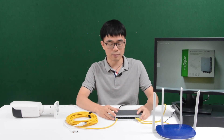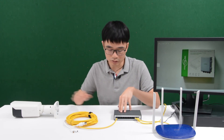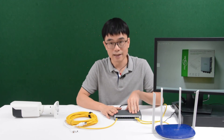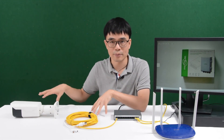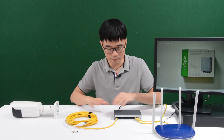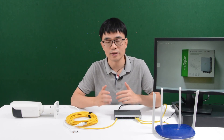The second question is about the power budget. All the power comes from this PoE switch, so you need to add up the power consumption of each of your IP cameras, and that total should be less than the power budget the PoE switch can supply. A switch like this one has about 60W of shared power budget. If 60W is not enough, you can pick another PoE switch with a higher power budget.